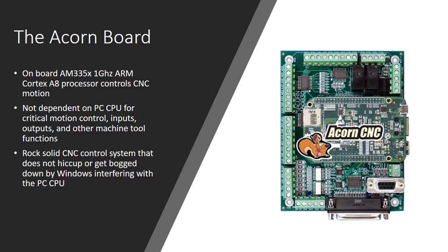The hardware is built around a single board computer called the BeagleBone Green from Seeed Studio. This is a single board computer that was actually developed with CNC control in mind — different from something like a Raspberry Pi. This board was designed from the ground up to do CNC control, and it has features that other single board computers don't have, making it perform better for that type of application. It's a really good choice to base this system around.